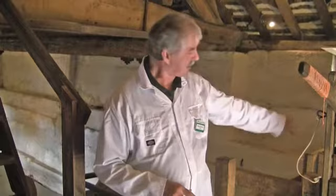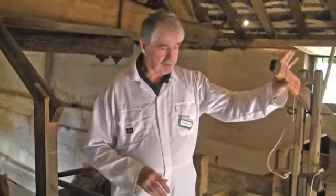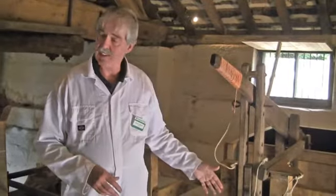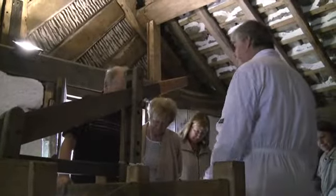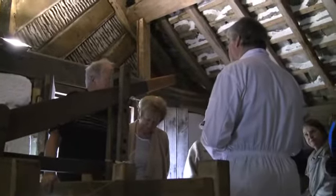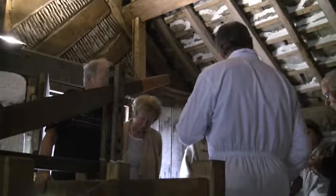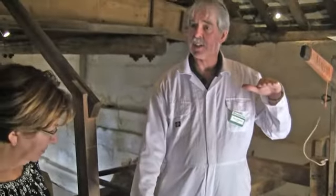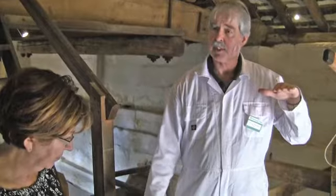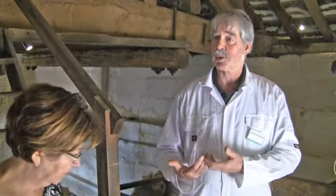The water comes in from the mill pond into this wooden box here, which is our pen stock — the ready-use supply of water. By use of the lever here I can open a flap in the bottom which lets water down the pen trough onto the wheel. We have two water wheels; they're both overshot water wheels. Overshot means the water goes onto the top of the wheel and turns it forward — a very efficient way of using water. We've got about a 30-foot fall between the level in the mill pond and where the tail race tunnel goes out under the road to take the water into Bolesley Brook. The two wheels are effectively one above the other but offset, so the water goes onto the top wheel, turns that, falls off onto another trough, goes down onto the top of the bottom wheel and turns that — so we're using the same water twice.